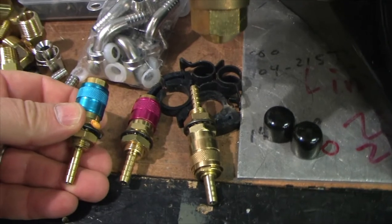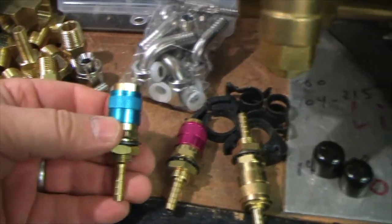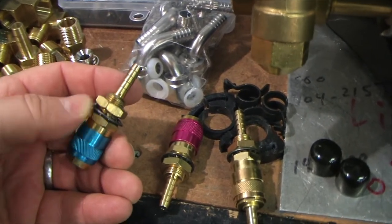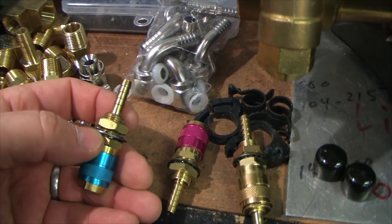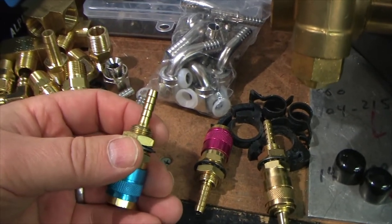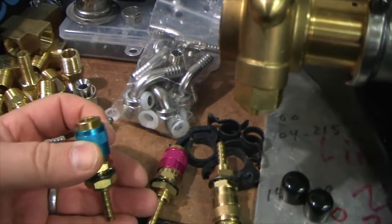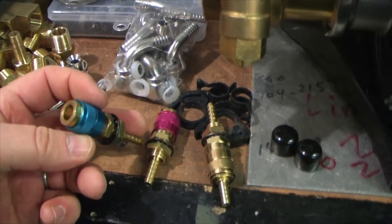There was a kit available with three quick-disconnect fittings for about $20, one for each color — which is appealing for welding since you can designate hot, cold, and gas. The problem is they're some sort of smaller than standard fitting, possibly metric, and a little loose in the 1/8 pipe I have. I'm not sure I can seal it under pressure at 50 PSI. I like the idea of quick disconnects since I have a couple of welders and different torches.